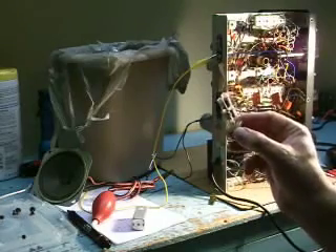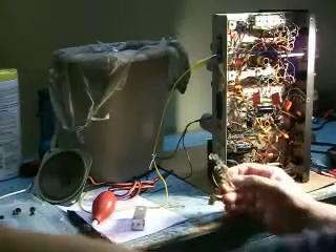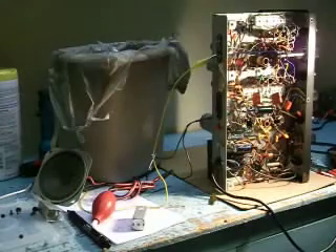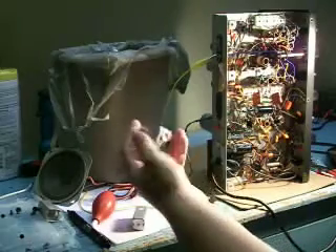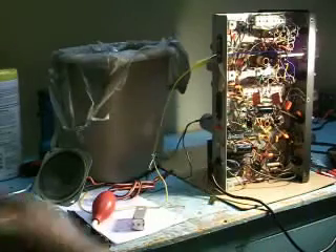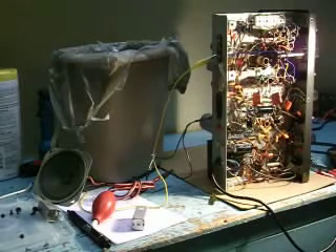This one I wanted as a keeper. Now what I used to do in the past is go through my IF can collection and see if I could find one that wasn't as noisy. But what I found is, generally, when they're noisy, they're noisy. Now this kind here — a little older design — has a fixed inductor and a variable capacitor. Rarely a problem with these. But this is the kind, and there's one way to fix them.